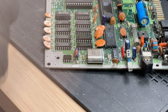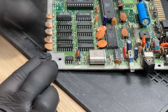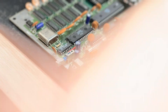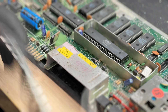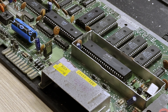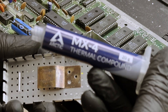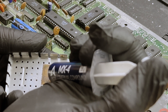Time for some gloves. Now turning to these capacitors — no matter what I did, I managed to get them to clean up a little bit, but unfortunately I could not get all that white stuff off them. Back to the back of the board, trying to get in all those nooks and crannies, get the data board covered and clean off the TED chip as well. The TED chip is known to run hot and the top of the case acts as a heatsink — it's even got a little bit of copper on it. So I'm going to take some Arctic MX4 thermal compound, pop it on there, and this will help keep things cool.